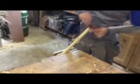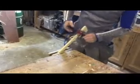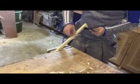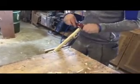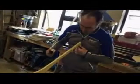So when I'm spoke shaving, the only thing I have to be careful of is the direction of the grain. Here you can see just as I'm finishing this stroke, it's starting to peel instead of breaking off. So what happens there is I have to now spoke shave up the way whenever I go to the other side. So now, again, give it a bit more strength. I just hold it in with my chest.